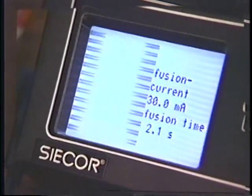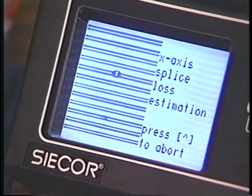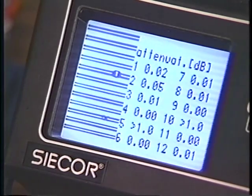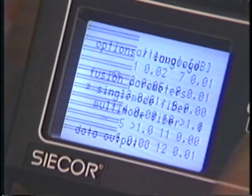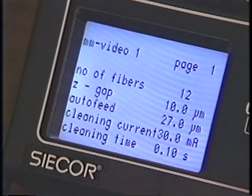When fusing a ribbon of multi-mode fibers, there can be great difficulty joining all fibers consistently, yielding about 7 good splices out of 10 attempts. You should use the multimode parameters provided. Cleaves must be very good and the electrodes must be clean.